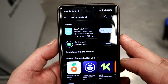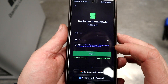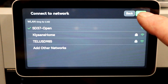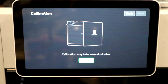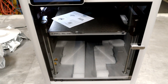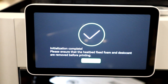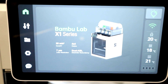At this point it's asking you to download the Bambu Handy app, which you can do on your phone or computer. Register and log in before you put power to the machine. Once you've got power going, go through the menus to set up your internet or skip it. Accept the prompts and start the calibration process — this took about 15 to 20 minutes. It goes through its range of motions, vibrates the motors, and does everything it needs to get set up. When it's all done, a screen will prompt you to take the foam out from underneath.